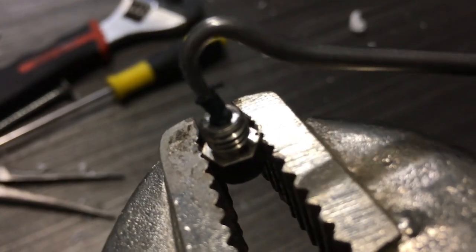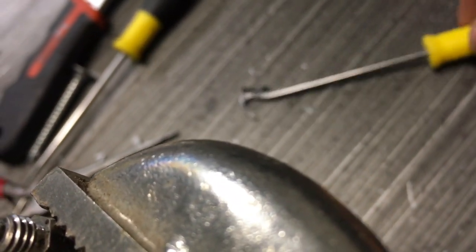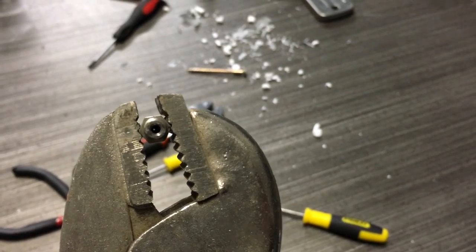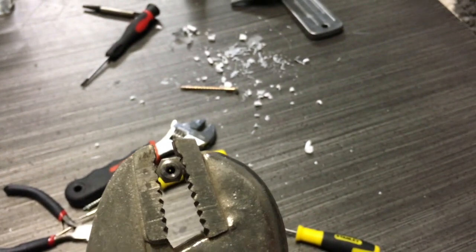Here's my third attempt — just grab it out real quick — and there we go guys, it's that easy. Notice the shape is pure solid as far as how the filament goes in. And if you look right here you can actually see a little white light coming through the nozzle, showing you that it is completely clear and there's nothing wrong with it.